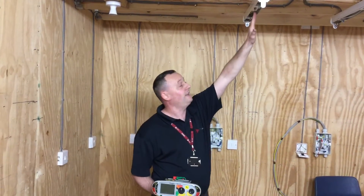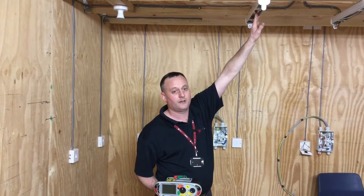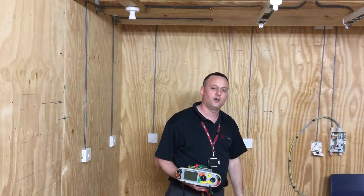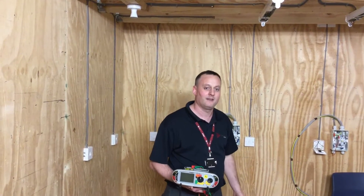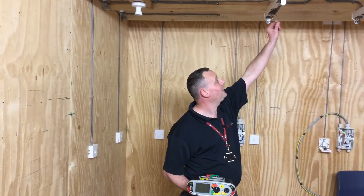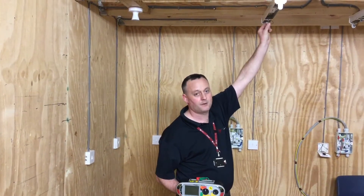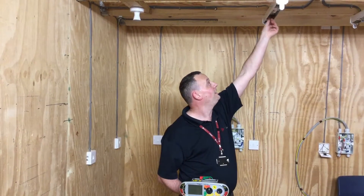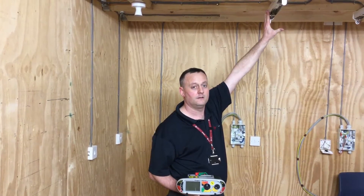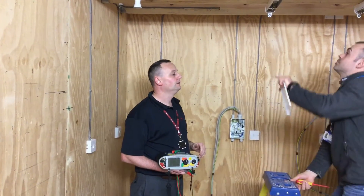The reason being, the fitting's inner guts are actually still connected to line and neutral. The electronic part of this fluorescent light fitting is currently connected to the circuit, and we've got the capacitor in parallel across it for power factor correction, which is also connected. To overcome this problem, we've disconnected the switching line from the actual connector block inside the fitting, left it on its own separate connector block temporarily so we can curl it out of the way, and then refit our cover on the fluorescent light fitting. That will be all covers on, all loads removed at that stage.